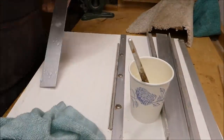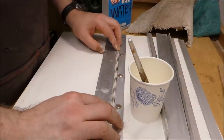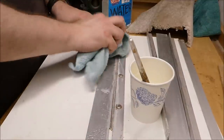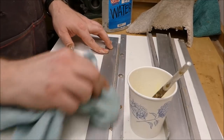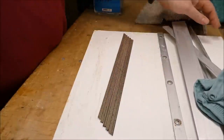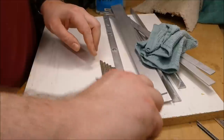To clamp these together, I use aluminum strips on a flat laminate-covered surface. A spray of water there provides enough surface tension that the aluminum stays where I put it — I just snug them up, push them together, make sure it's all flat, wipe off the glue, and move on to the next one. Before gluing up these smaller strips into the large sandwich, I'll mark off a 45-degree line and cut that across. This conserves material — I won't lose as much in waste when I glue these up.